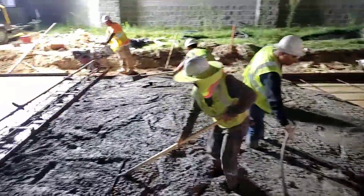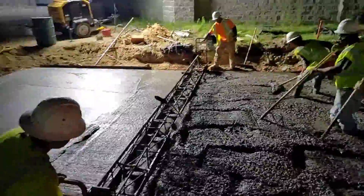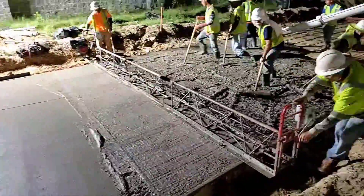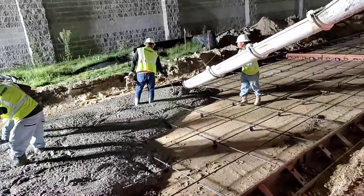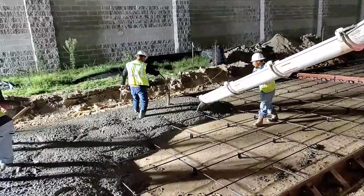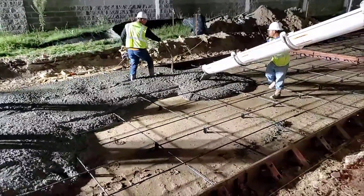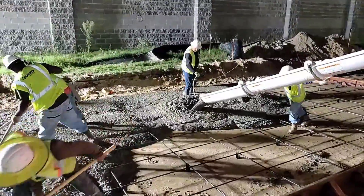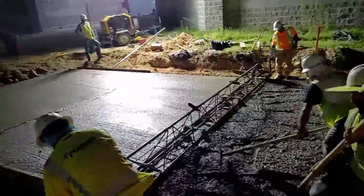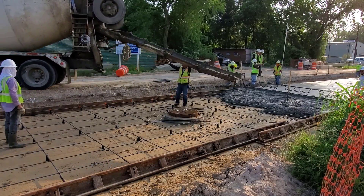This is about four o'clock in the morning. It's a 4,000 PSI concrete mix designed to last about 40 years. This is a vibrating screed — it has a rod running from one side to the other with a five-horsepower motor on one side that's intentionally unbalanced and spins, creating a vibration like a tire that needs balancing. That spreads the concrete. The concrete is being poured at about a five slump; specs call for four to six.